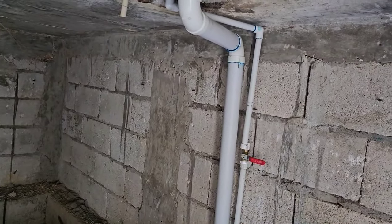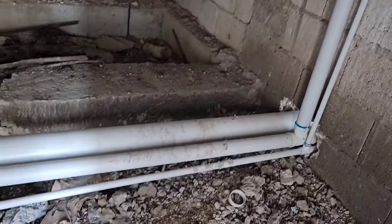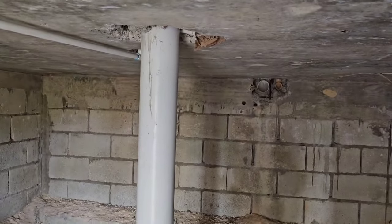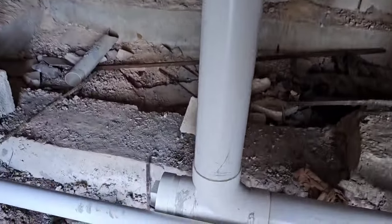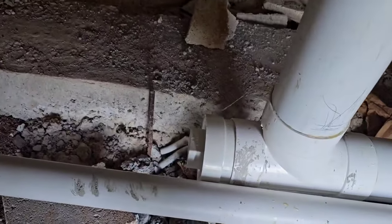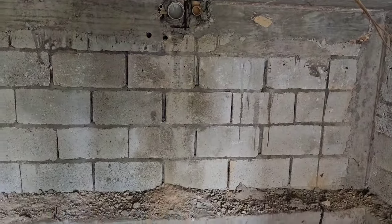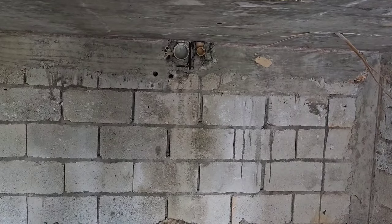This pipe here is going to go up to the shower. These are the pipe works — this one going up to the sewage, this is the sewage pipe. There's a clean out right there, and there's another pipe that's going to continue, come down, and join into this pipe. That's what the plumber did upstairs, so it's going to join into this when the time comes.